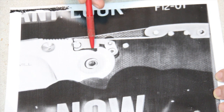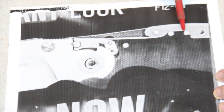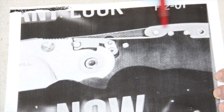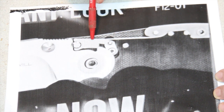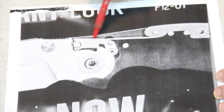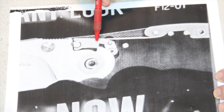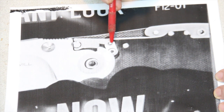Now the reason this will fall into place is there's a spring here. You can see this spring that comes in and has this curve, held in constraint by these two pins. And this is a plastic backspacer that holds that. The spring is giving bias downward, pushing this lock bar to rotate clockwise.